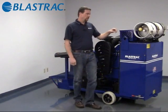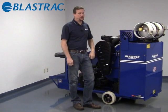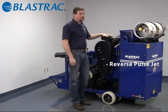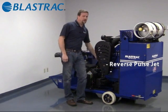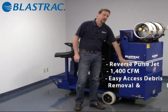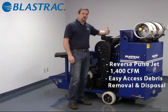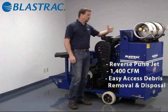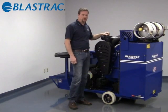The next feature on the 110 DLP is the dust collection system. It's a reverse pulse jet dust collection system that utilizes a two horsepower compressor. This is an industrial duty long life compressor, a 1,400 CFM blower, and six cartridge filters housed inside this bag house assembly. What that equates to is long service life out of your internal components. The more efficient your dust collector works, the longer the internal components — your wear parts and your blast head — last.